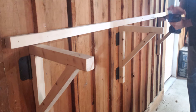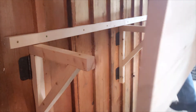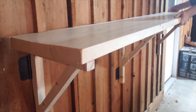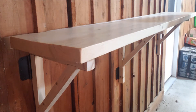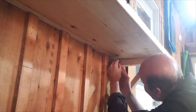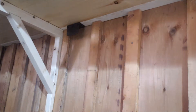There's that piece we're going to attach to the wall that we'll then screw the hinges to, which will also be screwed to the shelf itself. We're just setting it in position and screwing it into the wall. I noticed we have a small problem — those won't fold flat against the wall because the other battens are in the way. But we'll solve that in a moment. First we're going to throw the countertop on there just to see how everything looks — and I was pretty pleased with how that turned out. It passes the finger tapping test so we're good to go. Then I go underneath and screw one side of the hinge into the piece on the wall and the other onto the shelf — three hinges total, one in the middle and one on each end.